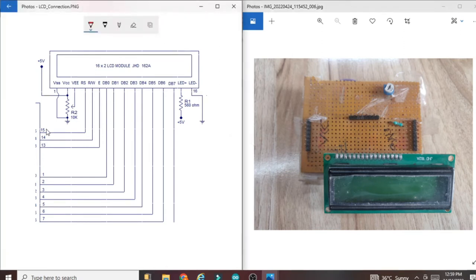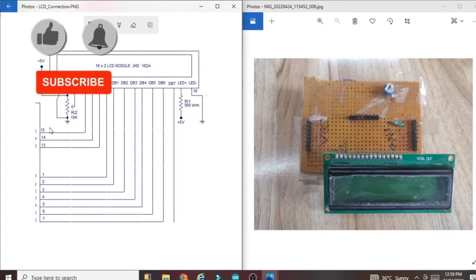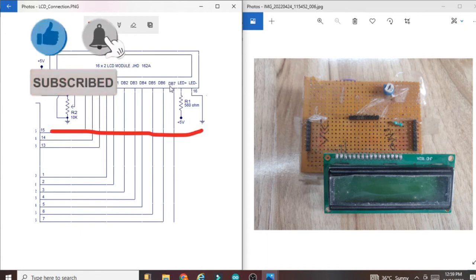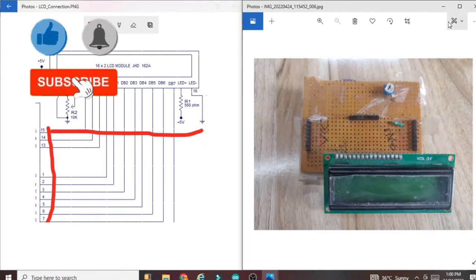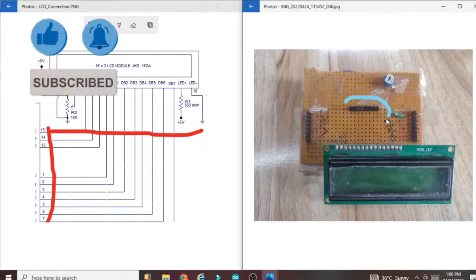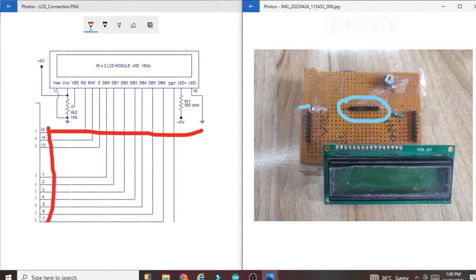Once you design this circuit till this point, you can directly connect any LCD pin to any controller, and this represents the controller pin basically. You can replace any controller at this point. Whenever you require Raspberry Pi or Arduino, you can just do plug and play with this circuit. This is the common VCC point, this is the common ground point, and this one is your input point.